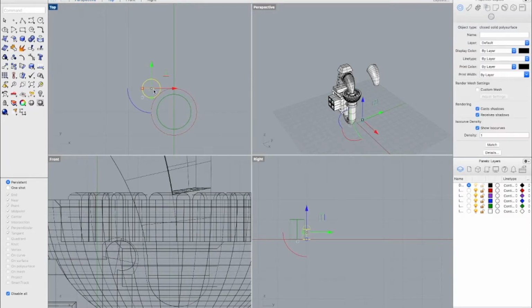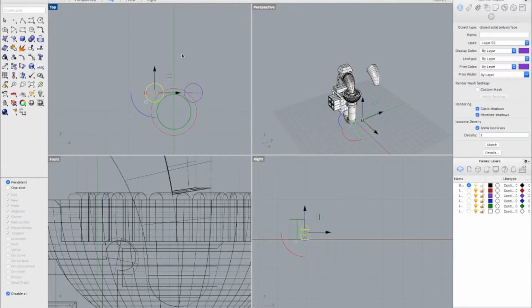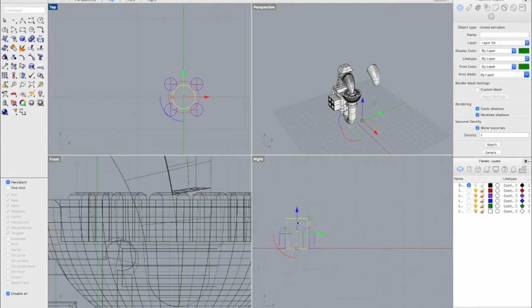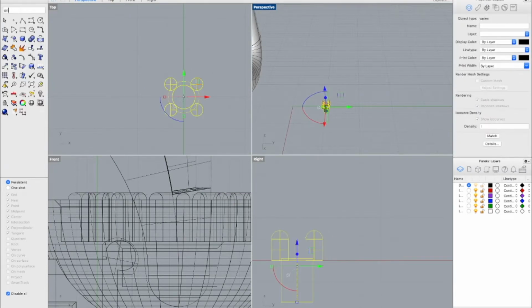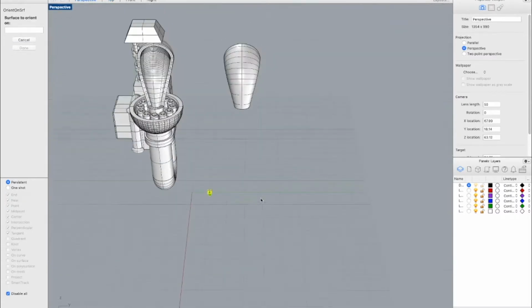My process for creating a pave pattern in Rhino starts with creating objects that emulate the components of a four-prong stone setting. A pilot hole to assist in cutting a seat for the stone, four prongs measuring 0.8 millimeters in diameter and placed at each corner of a circle symbolic of my 2 millimeter stone. I change the color of each component so they can be easily identified.